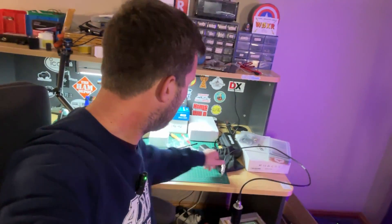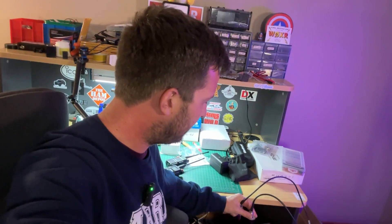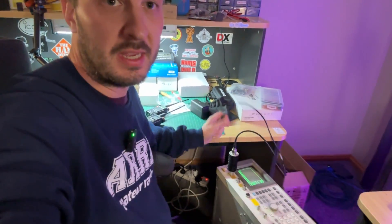This is 0.4 MHz to 1 GHz. We've basically got a 20 dB through-line attenuator here, and just a short bit of low-loss cable — RG223 — with a special connector on the end for the SMA to go into the radios.